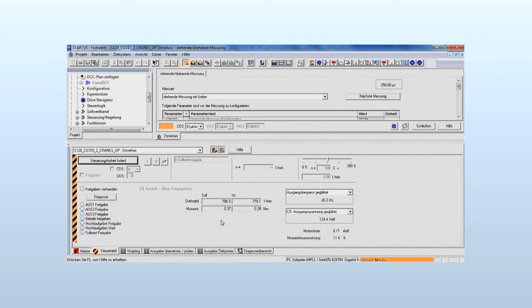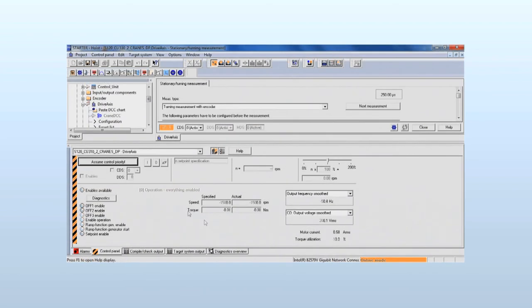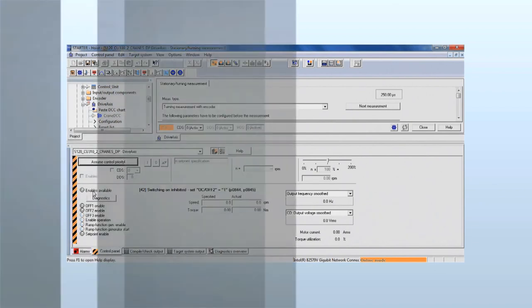After setting of the HW release, the master switch is moved to various forward and reverse speeds. The drive should change speeds accordingly. The control panel shows the corresponding reference and actual speed and torque values. The drive is stopped and switched off by removing the hardware enables via the control desk. The control panel confirms the status.